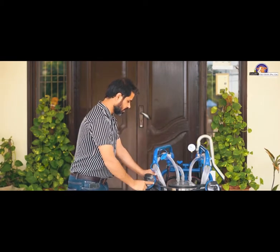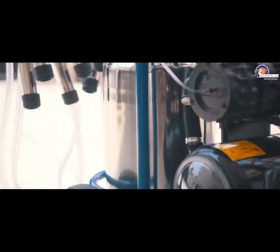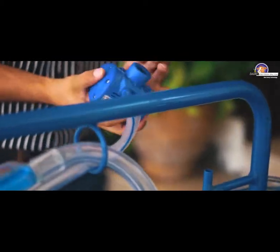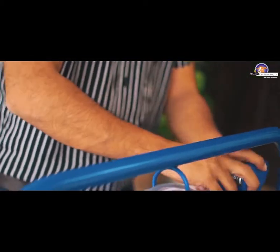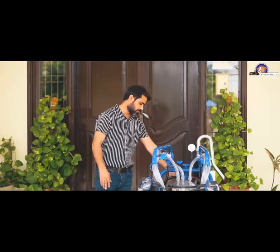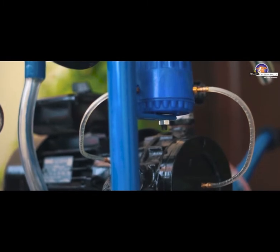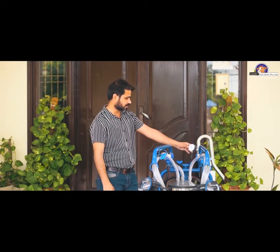This bucket has two clusters connected with a 40-liter capacity. There are two pneumatic pulsators on the machine which generate pulsation, and there are two channels distributed across 4 quarters. The vacuum pump is connected directly to the motor — it's an oil-lubricated vacuum pump with a vacuum gauge for pressure maintenance.